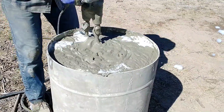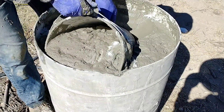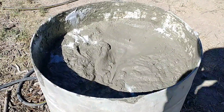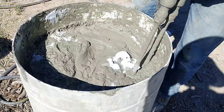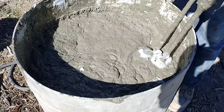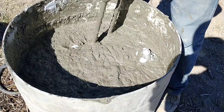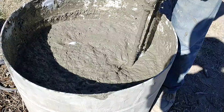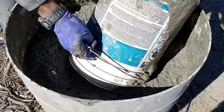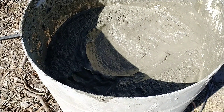Here we are mixing up the next batch. So far the batches are going really well, only taking about 20 to 25 minutes each. This batch was a little interesting — when I dipped out the first bucket it looked a little too bubbly, so I went back in and mixed it some more to see if that would help, and it did. I think the top of this batch was a little under-mixed, and going back in and mixing more seemed to help without hurting it. So we confirmed you can go back in and mix it more after stopping, and it seems pretty stable.